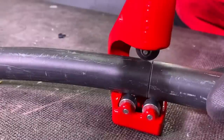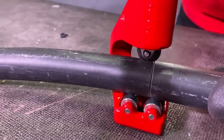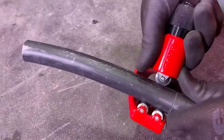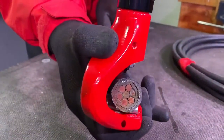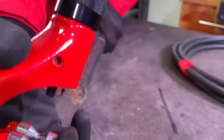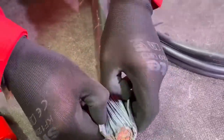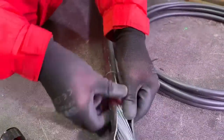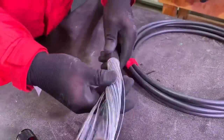So you're backing it off now. Here's the clever bit — the second function of the tool. Turn it at a right angle, and then you can use the rollers in another way, and just pull it down to remove the outer jacket. It's got to be really firmly into the tool, and you know when you've got it right because it feels like you're going over a rumble strip in your car. You're never going to cut through the steel armours because obviously they're wrapped around, so you're never running down an individual armoured that could damage the bedding material.